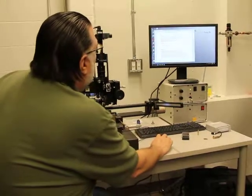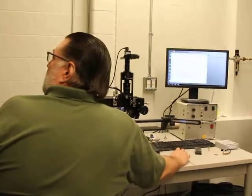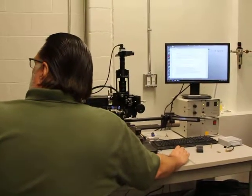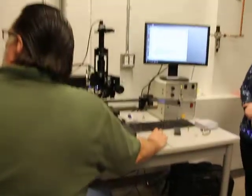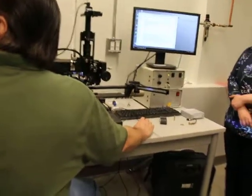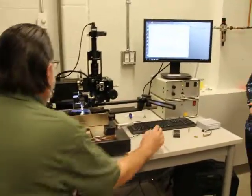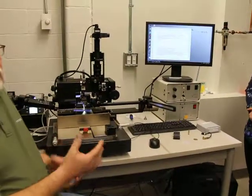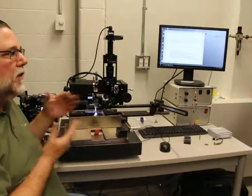So this bonding is for solid to solid. Does it mean, for example, because it's temperature based, I'm wondering, let's say the dies are from polymer, could this actually be bonded on the surface by controlling probably the temperature? Yes, yeah. But the temperature can be very low. So yes, you can adjust. And with all these processes, you don't have to, that's why before I was saying some people are just heating from the bottom, they're not heating from the top.